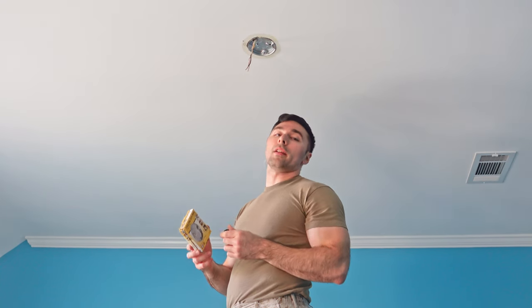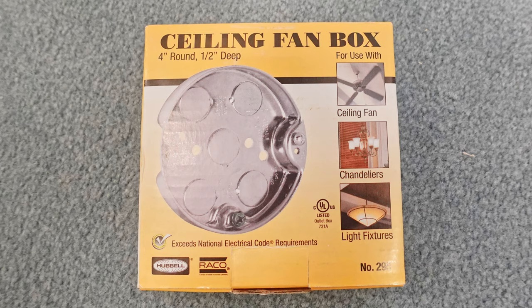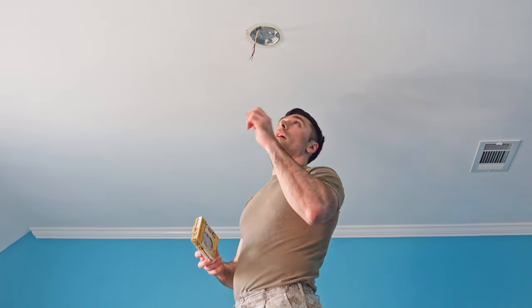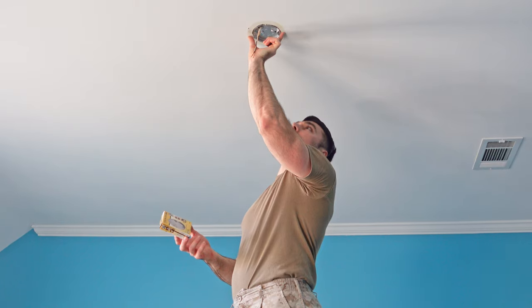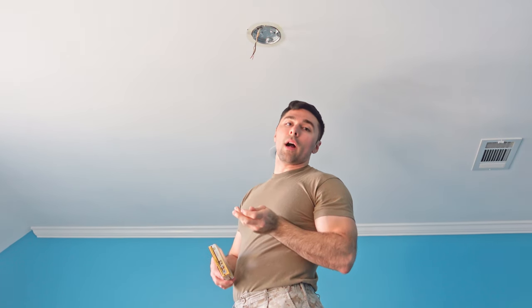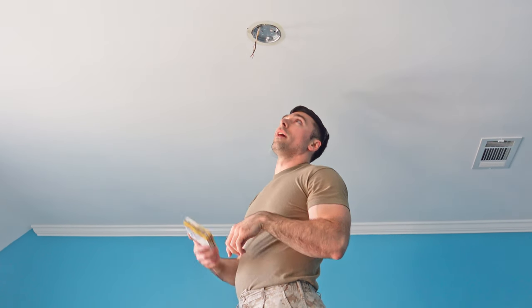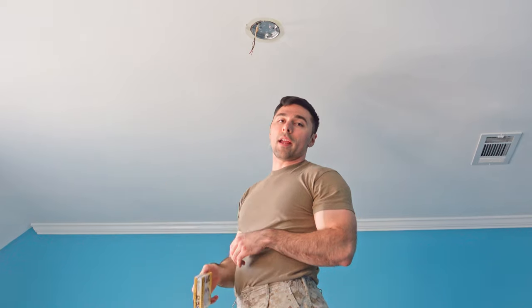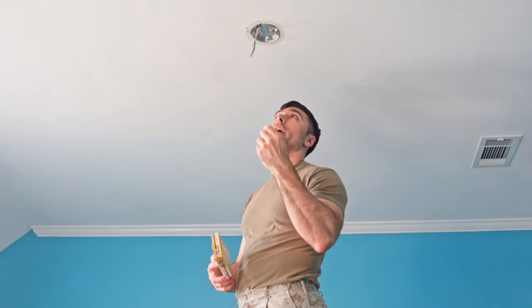If you have to go to the store and buy an electrical box, for a pancake style box you're going to find two different versions. You'll find a normal one that is not ceiling fan rated, and one like this that says ceiling fan on the box. This one is strong enough and has enough hardware to mount to a stud to withstand the weight of a ceiling fan. For this particular ceiling fan, mine is not going to be used to mount it because the bracket doesn't fit — the bracket is going to go into the joist itself. So in this case it's really just here for the electrical wire, since it wasn't up to code without an electrical box. One nice thing is it's about a dollar more than the non-rated ones and it comes with all the hardware and its own Romex cable clamp, so I'm going to use that to bring this up to code.